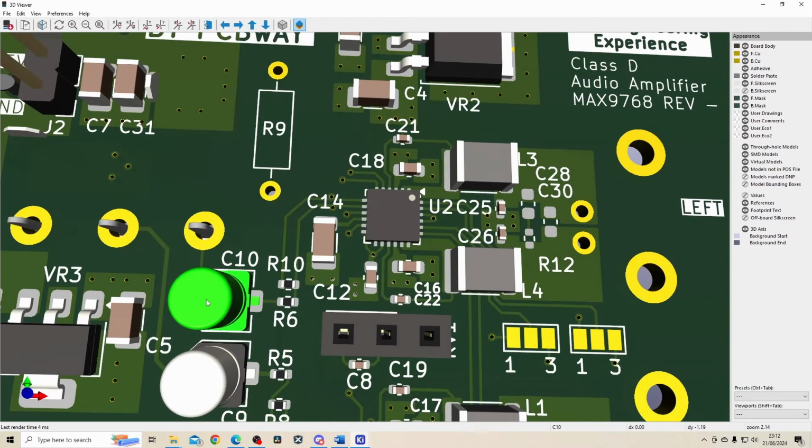The reason why I've used electrolytic capacitors is that the capacitance doesn't change very much with respect to voltage. So I think they're good for audio applications like this. And obviously this LC filtering is just recommended from the datasheet. High quality components and good placement is important.